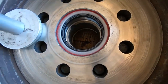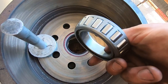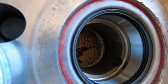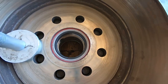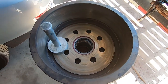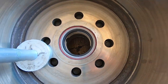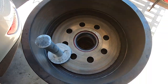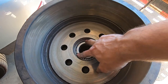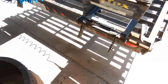Alright guys, tech tip. Before you put in that seal, make sure your bearing's in it. Yep. There goes the $30 seal. Cool. Alright, I'll destroy that seal and put the bearing in and put another seal on it. Make sure that's in there. Because otherwise...